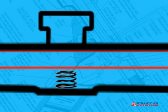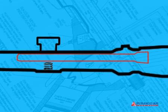When the erector tube spring fully relaxes, the erector tube is free to move around from the vibration of each shot, and the scope will no longer hold its zero. This is very important to remember because this is the most common cause for accuracy problems with scoped air rifles. Because of the problem with downward angled barrels, you cannot always simply mount a scope and then adjust the knobs to sight in. Many times, the scope has to be mounted in a special way to eliminate a lot of the barrel angle in relation to the scope angle before proper and accurate sighting in can begin.